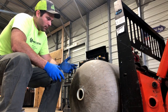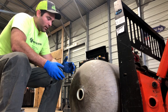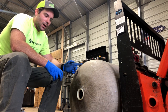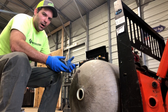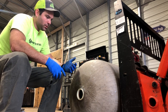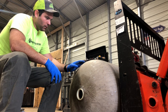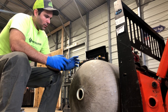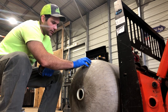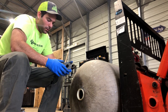So it was my original intention to fill this with water and I still might, because this is something that I have a lot of friends that like to borrow. If I fill this with concrete, they won't be able to borrow it because I won't be able to get it anywhere — you would have to pull it up on my trailer with the tractor. So I think what I'm going to try to do is keep the idea of filling this with water. The issue is this does not have a secondary hole on either side that you can fill with — you're going to be using this hole for the bar that's going to be running all the way through the center.